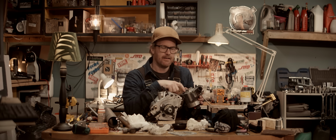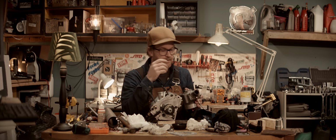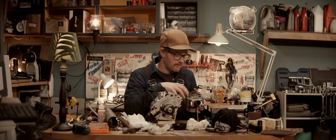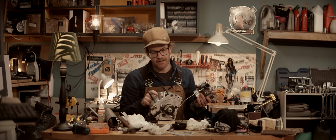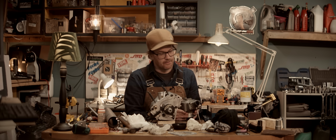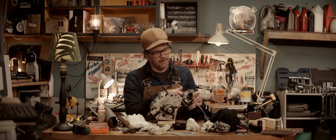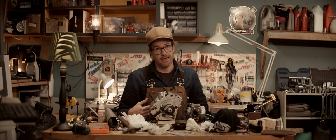The transfer geometry is fairly normal. The exhaust port width is, well, not normal, but normal in racing applications. The proximity between the exhaust port and the A-transfers is also normal in racing applications. My transfer ducts are normal in racing applications. Crankcase volume, normal in racing applications. Rotary valve timing, normal in racing applications. Squish gap, ring clearance, normal in racing applications. There's one thing left here that's not normal, and that's my exhaust port height, that it doesn't protrude below the transfer roofs. And this is great for velocity, and there's more than enough area in that exhaust port for combustion gases to escape fast enough.